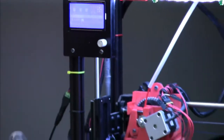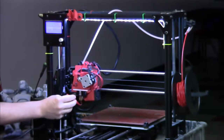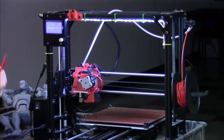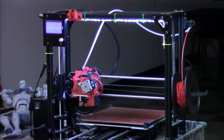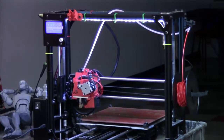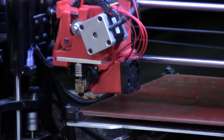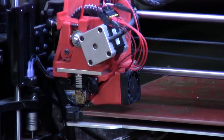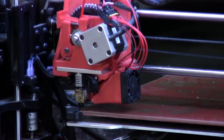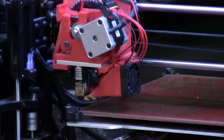Since this has already been at temperature for a little while, it has collected a little bit of plastic discharge. You can just pull that off with your tweezers and it'll be fine. A common problem that you might find is that the filament does like to attach to a hot nozzle almost as much as it likes to stick to the bed itself. So it's not necessary, but it's good practice to keep that clear so that it doesn't bind and turn an otherwise ordinary print into spaghetti.